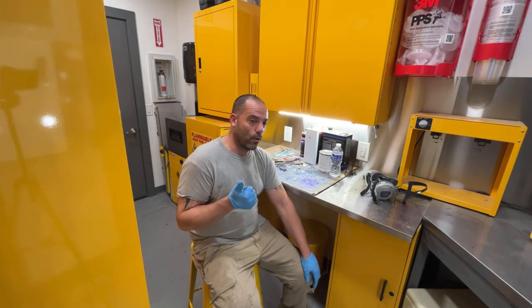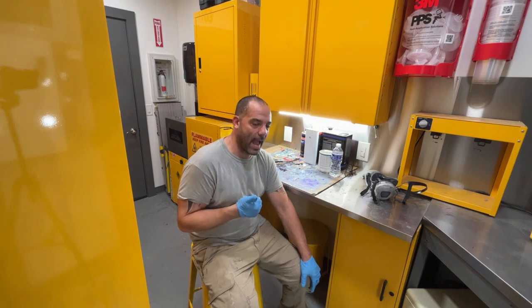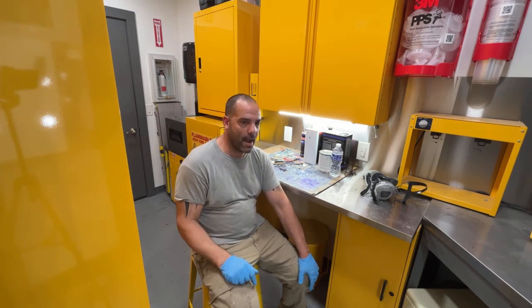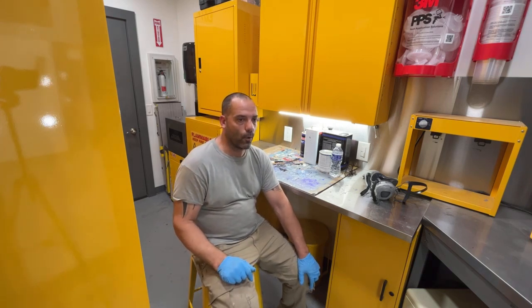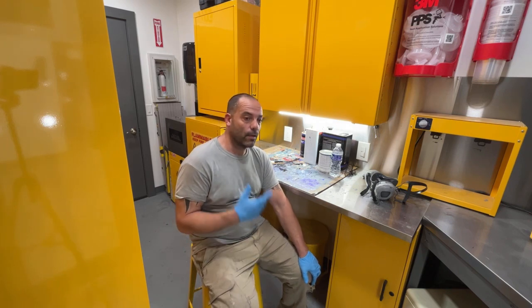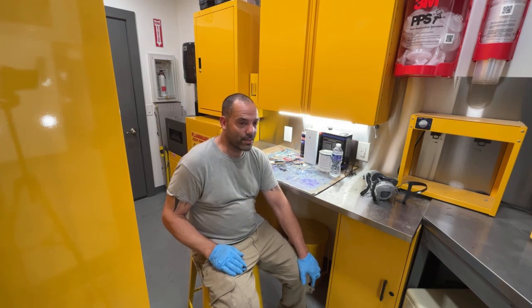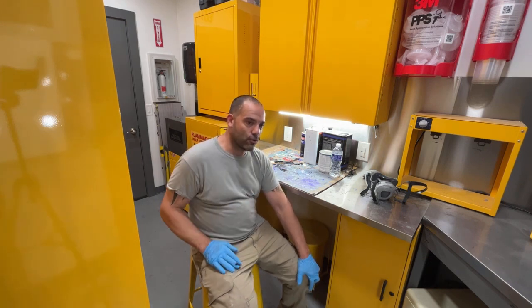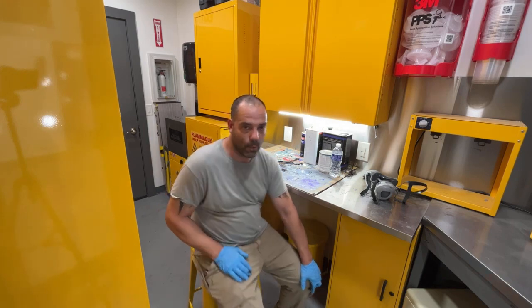And we have a good coat of epoxy primer over the bare cast, and then we're gonna have two good coats of a single stage urethane over top. So it should last quite a while before it starts rusting again. Will it start rusting again? Yeah, because that's just how cast iron is. It just eventually rusts again. No matter how well you treat it, it always comes back. So all right, I'm gonna let that dry for about 10 minutes and then I'll come back and we'll put one more coat on.